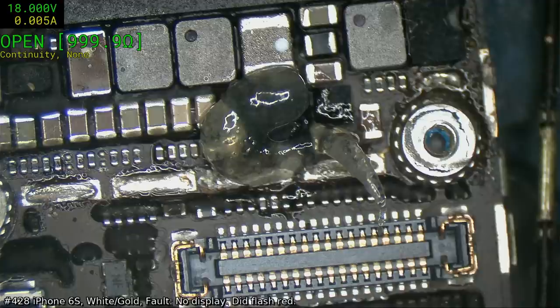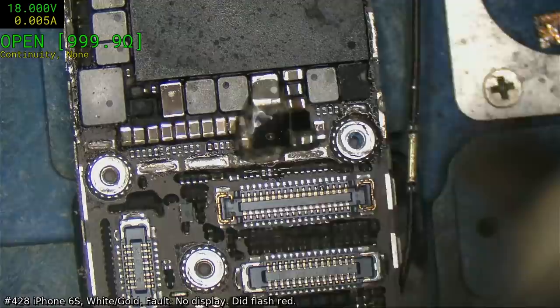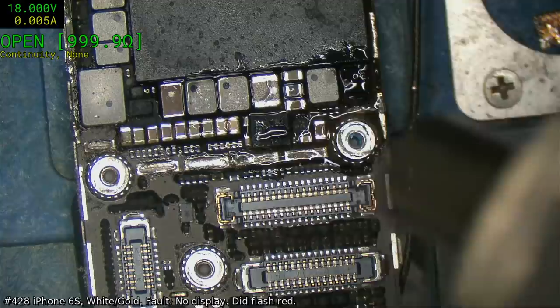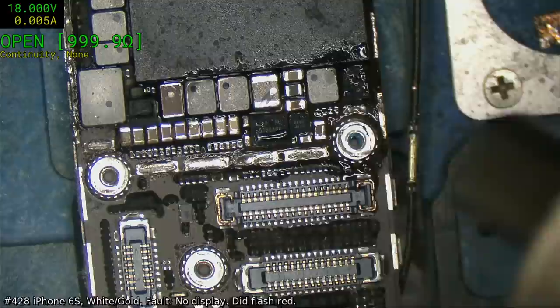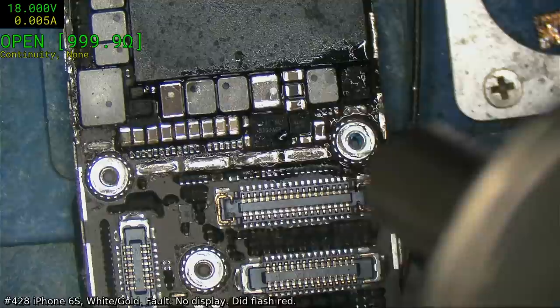Okay, what we're going to do is sit at about 370, 60. Essentially we're going to end up heating the board ourselves a bit, just get some sort of warmth through it. And then we're going to drop the air right down. So if I'm running at 60 litres per minute, I'm going to drop it down to about 30, even though it's probably going to be a bit much.